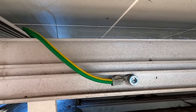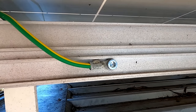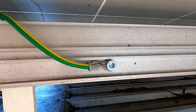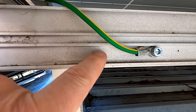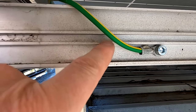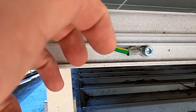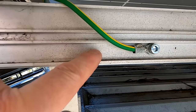So far I have done the earthing of the rail system like this: cable coming in, I've got a ring crimp to it and it goes with a star washer directly onto the aluminum. This is all anodized aluminum because it makes it stronger - it basically increases the strength of the material. And you need the star washers to pierce this layer to get down to the aluminum.